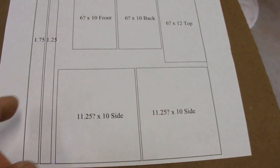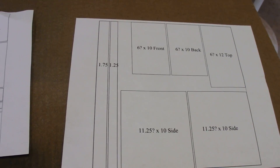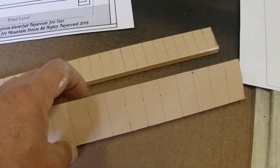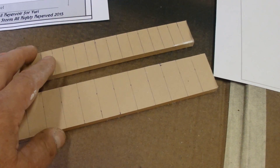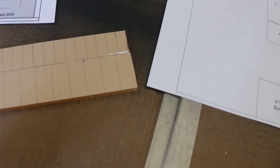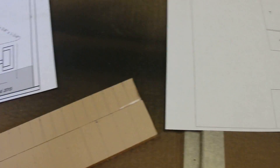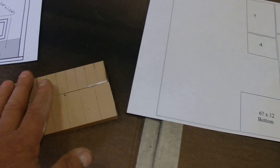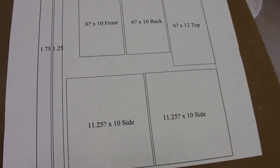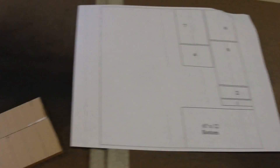You'll see little question marks for everything because I want to stack everything up and get actual numbers. I could say I want to make that 6 inches, but if it ends up a little bit wider or narrower once it's stack laminated, there's a certain amount of slop that builds up when you're stacking things together, even when fusing with acrylic. So I'll do my measurements after I've made these — that'll give me my internal and external sizes, and I'll know exactly what size to cut. But they're going to be pretty close to the listed sizes.